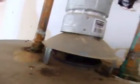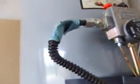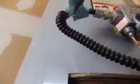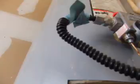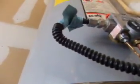Now, water heaters are notoriously difficult to guess whether they're going to go out or not, but let me tell you something about them in this part of the world. They only last about 6 to 10 years. So the water's very acidic, and they go out very suddenly, start leaking. So this water heater is probably getting to the end of its safe working life.